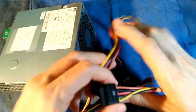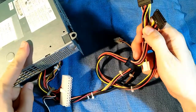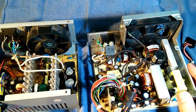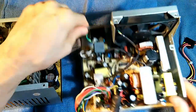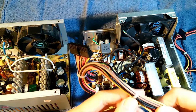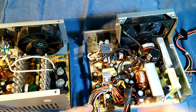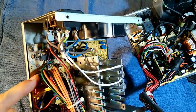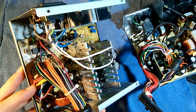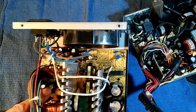One of the parts it has is a nice SATA cable. What we're going to do is remove this SATA power cable from the broken power supply and splice it into our old but still good power supply. I've removed the tops off both power supplies — this is the old one we need to add the cable to, and this is the broken one we're taking the cable from. It's a matter of following the colors back to where they solder in, desoldering them, and on the receiving power supply, just adding the wires matching up the colors — red for red, yellow for yellow, orange for orange. I also notice this old power supply has a swollen capacitor that will have to be replaced.